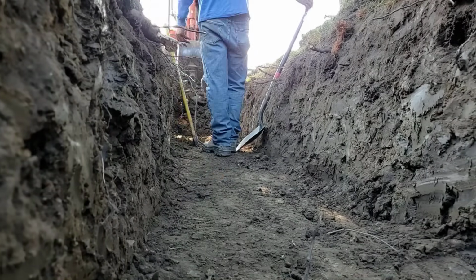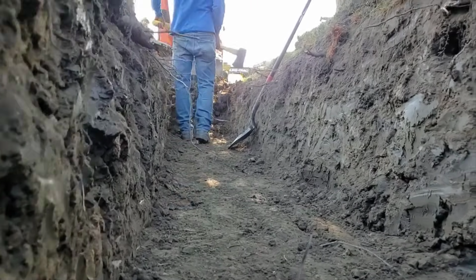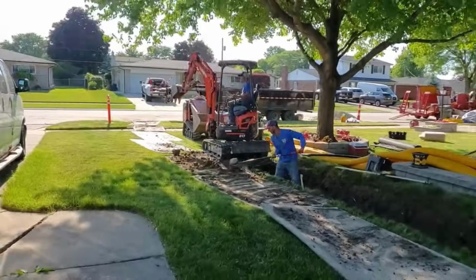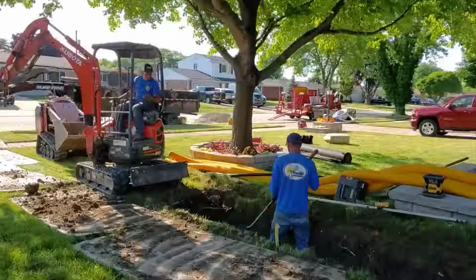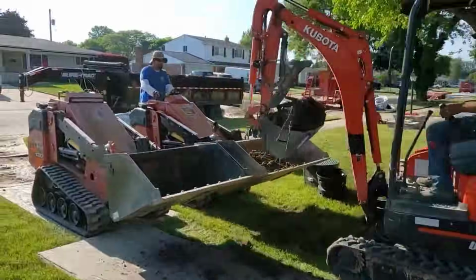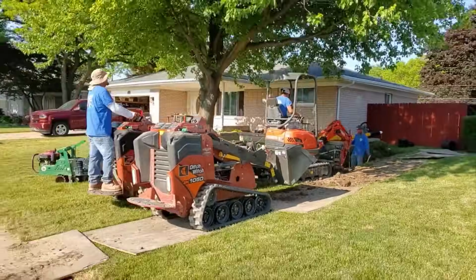You want the water to load into those knife cut pipes. The knife cuts, remember, are not ground out. Those cuts are made with a razor blade-like tool. So when Baughman Tiles runs a bunch of knife cut, these blades don't grind. They don't remove material. They just slice. So you get a sweating effect, which is the best way to describe knife cut when you load it in a leach field and use it the way we're using it.